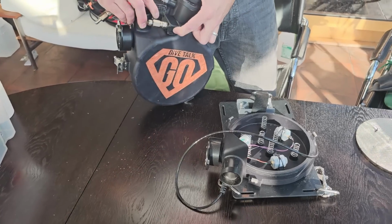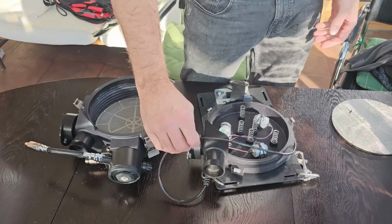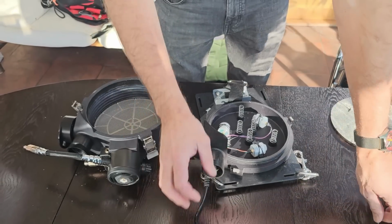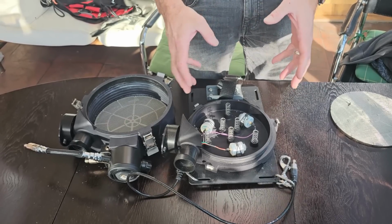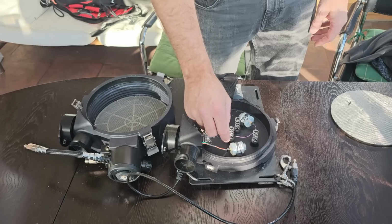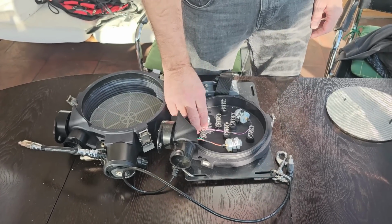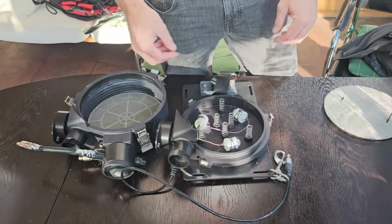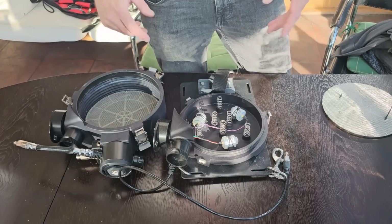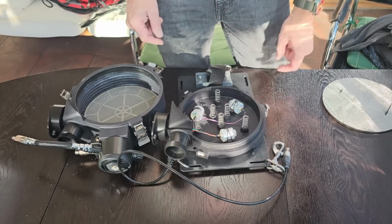Here's the inlet for the oxygen. It has a constant flow of about 0.7 liters per minute. Here you have the oxygen cells. Also, this is all very, very simple. So these are tucked in with these little rubber bands here. Very stable connection, actually better than the old RD22s with these 3-pin connectors. So that's all really nicely thought through.